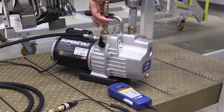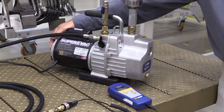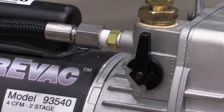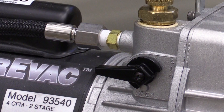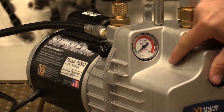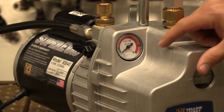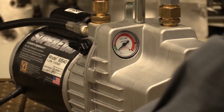Finally, once complete, we open the vacuum relief valve back to the vertical position and turn off the pump. There's been some confusion on what the blank off valve does. When you turn to the closed or horizontal position, it isolates the pressure only to the internal system of the pump. Your gauge will show green, but it's only pulling pressure internally. As seen on the pressure gauge, there is no decrease in microns, meaning there's no vacuum being applied.